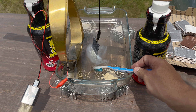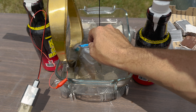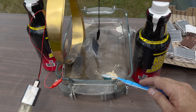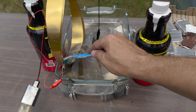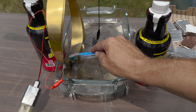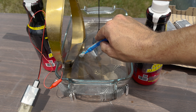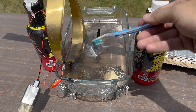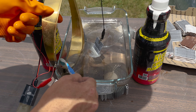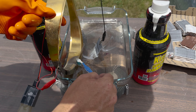It's coming off dark — that's good. That's the gold and whatever else is going to come off with this reverse plating. With it being sulfuric acid and the lead plate, this should effectively take off all the gold. You can kind of see there's a color change between this metal here and that gold plate, so let's go ahead and spin this again.